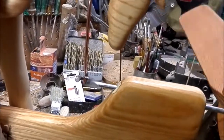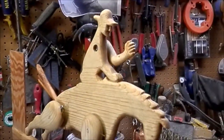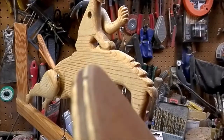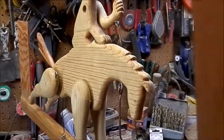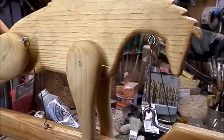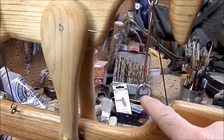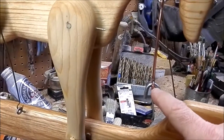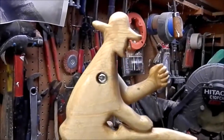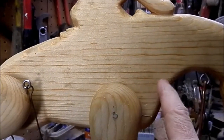the throw on there is quite big. So I took it out in some light winds yesterday and it wouldn't turn — it just has too big of a hill to go up. How I would fix it would be to make a new crankshaft with a smaller throw, a little less aggressive. I'll get a little less movement on it. The other thing is I want to change the center of gravity on here — move the hole to the left on the body.